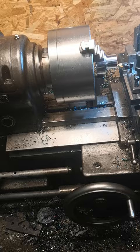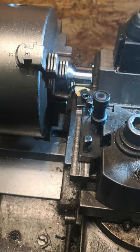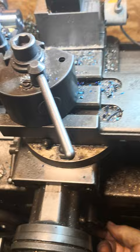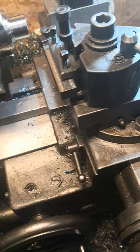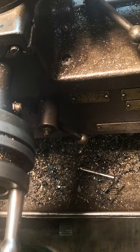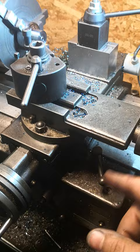It is the morning so I'm fresh to make some clips. You have to locate your stopping rod so it will stop when you are at the place where you want to stop. You have to do this before you start the machine, so you do this in a dry run. When pressing the lever, you can see it moving — when you hit the point, the lever moving down is disengaging it. It has two directions where it can disengage: down and up. The bar inside goes left and right, and inside there is a triangle that kicks out a pin underneath from the half nut.